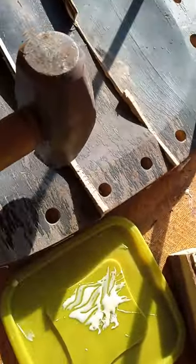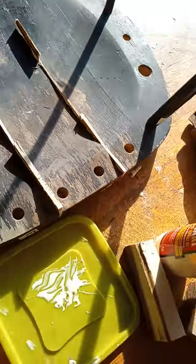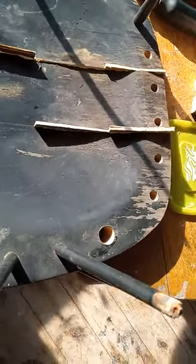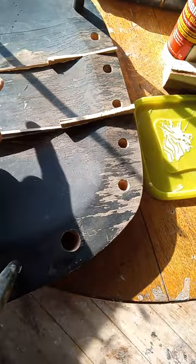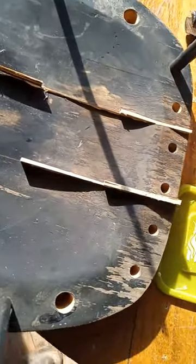Then you take a hammer — no need to use such a big one — tap it lightly, tap the wedge in there. You'll never clamp this crack. I put a bar clamp on there and you cannot. I worked in a cabinet shop 26 years — you cannot clamp this crack. It's a stress crack, it's like that forever. So that's what you have to do: patch it with wedges.